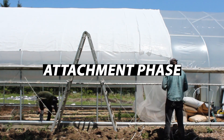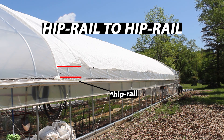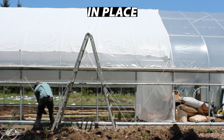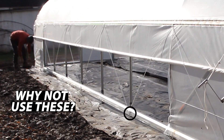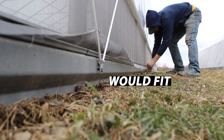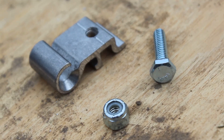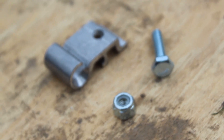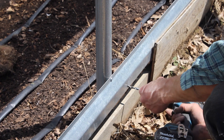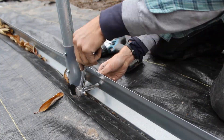At this point, I'm going to pause and get ready for the attachment phase. This piece of shade cloth is slightly narrower than the distance from the hip rail on one side over top of the structure to the hip rail on the other side, so we're going to install easy snap hooks in the baseboard so we can use a zigzagging rope to hold this cloth in place. I'm going to space these easy snap hooks on the baseboard right around eight feet apart from each other. Using a quarter-inch drill bit, I'm going to drill through the metal baseboard and bolt the easy snap hooks using a lock nut, a wrench, and a 7/16-inch socket.